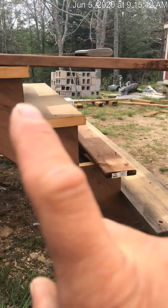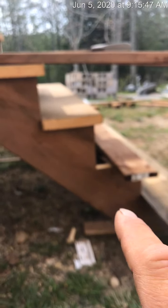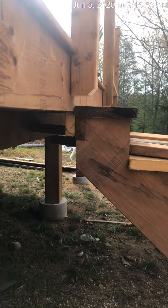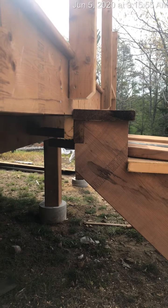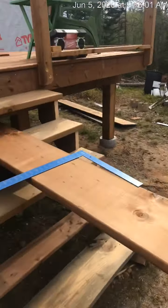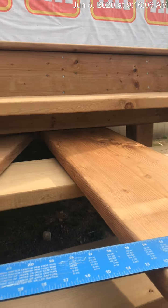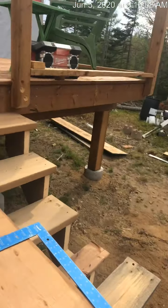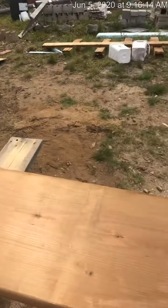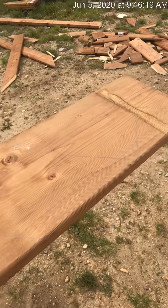As you can see, I've got my treads and they have about an inch overhang on each one, which is most common with lots of carpenters. I've even notched the back piece for a fastener which goes right straight through the back of the stair — that way you can fasten your stairs. As you can see there it goes right through and we fasten our stairs to that so they actually hang and don't fall off. That pretty well covers a basic tutorial on stairs.